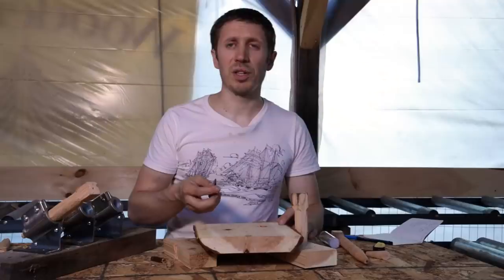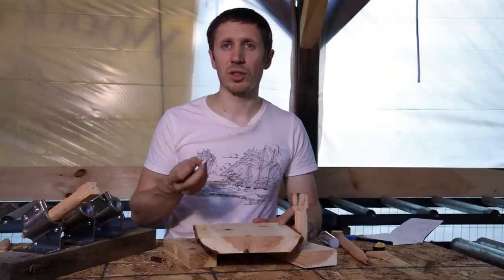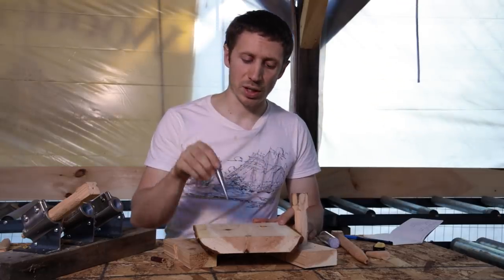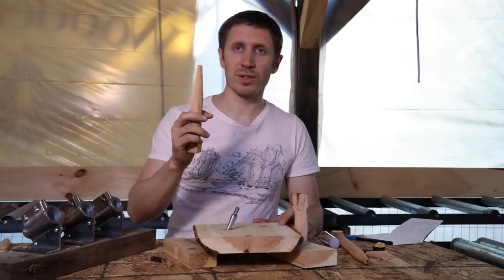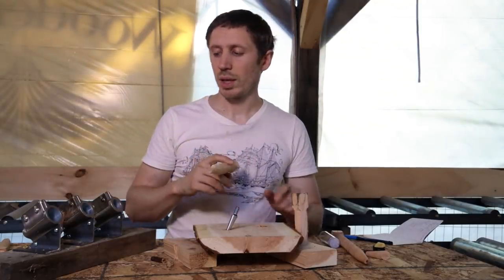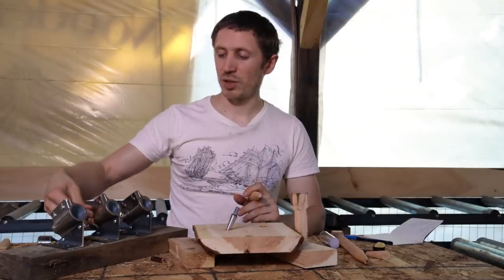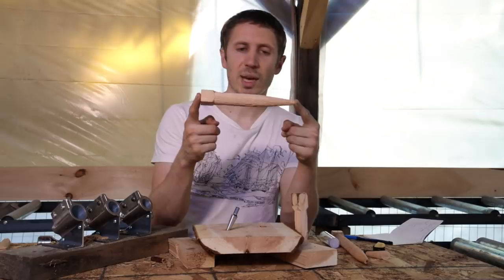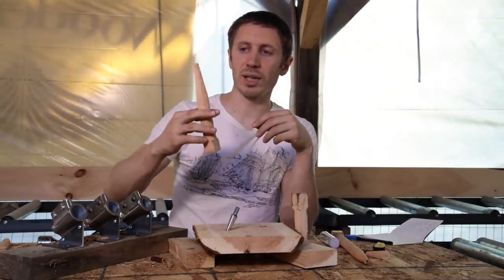We've done our research, and basically you want to put a plug into those, and the best way to do that that we found is to put in a tapered plug. So we're going to take this tapered reamer, and you ream out the hole until you can fit in one of these dowels. It's a tapered dowel, and to make those, we basically got these souped up pencil sharpeners. You would make a dowel, and then as you twist these in there, it cuts a taper on the end.